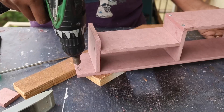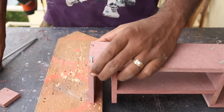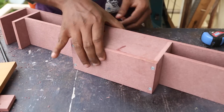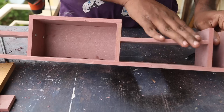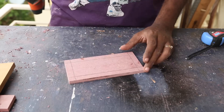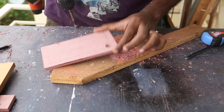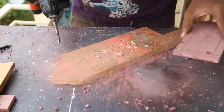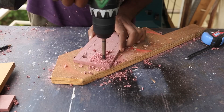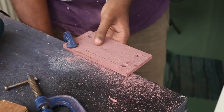Here I'm making the space for the soldering iron. Once all is assembled, I will take everything apart and attach it permanently with glue. For the back door of the fan, I have a 160 by 80mm MDF piece that needs a hole in the center to let out air. I marked the edges first, then created corner holes using a Forstner bit, and using a jigsaw I connected these holes to create a bigger hole.